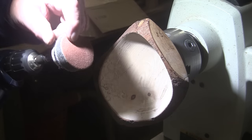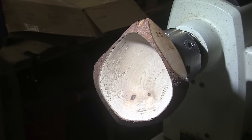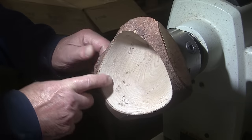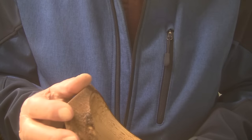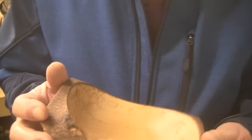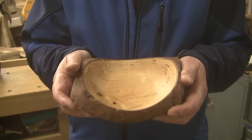I'm starting with 80 grit, working up through 400. I have the piece spinning forward and reverse at about 380 RPM. I'm starting at 80 because I noticed some punkiness where the spalting is — that's not unusual — so I'm trying to get that out of there. I don't know if I'll get it all or not. I'm going to go ahead and put the finish on. I'll bring you back here in a little bit and we'll take a good look at this thing. Be sure you stick around at the end of the video so you can see the before and after shots.